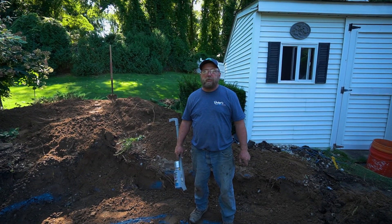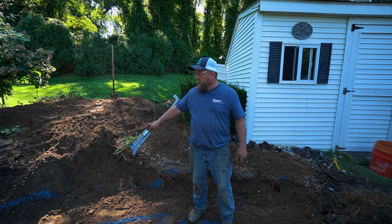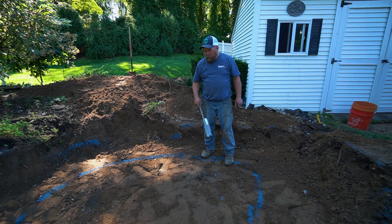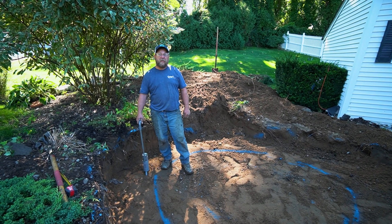What we're doing now is shelving out our pond. This particular pond is going to be three feet deep so what we're going to do is two 18-inch shelves. We've dug our first shelf here, 18 inches all the way around, and if you look we've got blue spray paint painted out — that part there we're going to drop down to the three feet that we need. The reason we shelf these ponds is to make them more structurally sound.